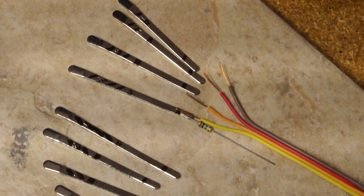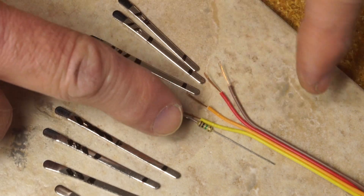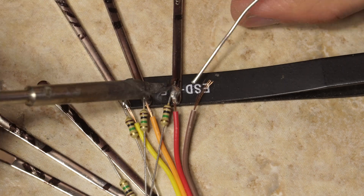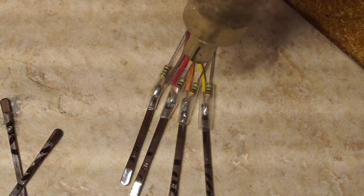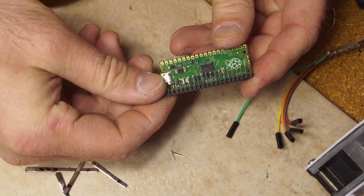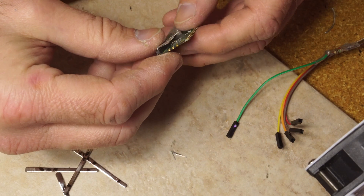Using the capacitive touch sensing on the Raspberry Pi Pico requires a one million ohm, or thereabouts, resistor. What I'm going to do is solder that on here and then basically make a bus to the ground. It's kind of an unconventional setup for these headers, but I'll be able to plug things in from the side and save some space, and still be able to glue it down.